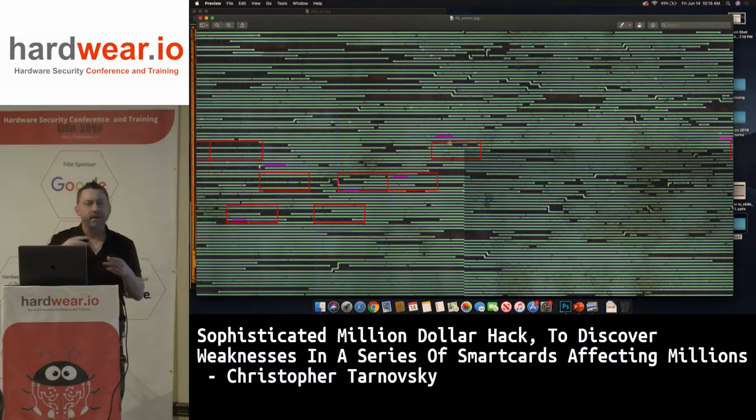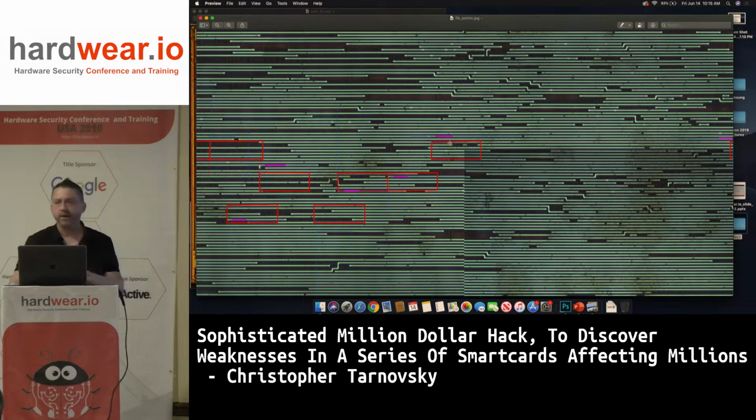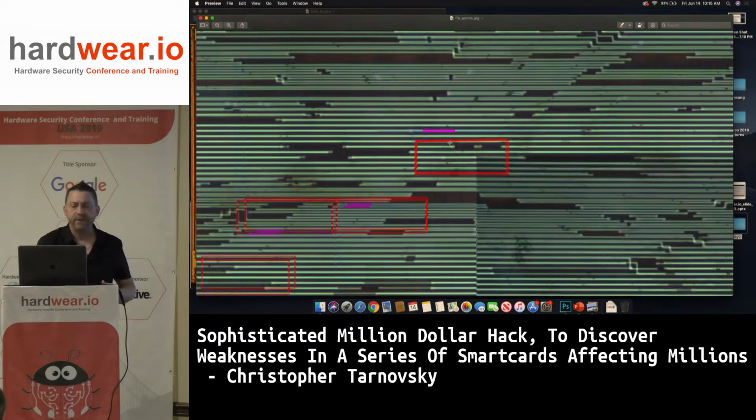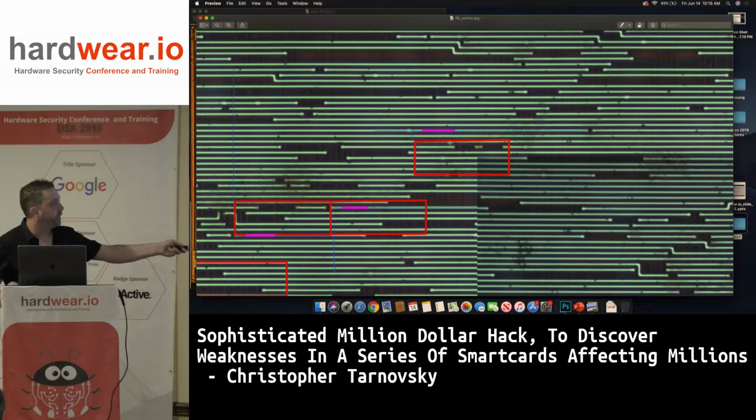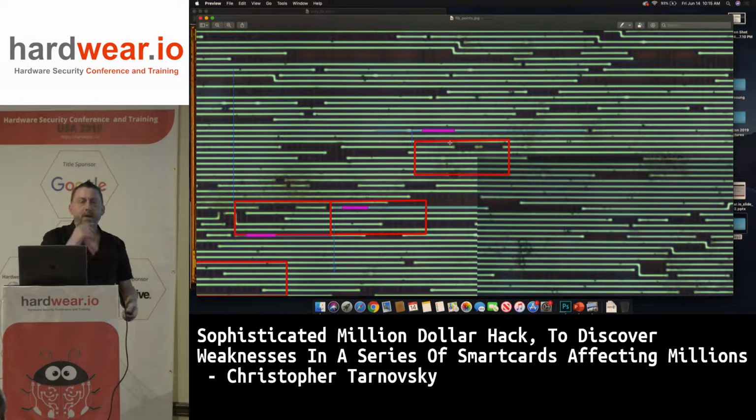So I'm going to put down needles and I'm going to just walk on the bus. Walking means I'm listening and I'm not going to change anything. I'm going to let the processor run. So it's going to give me back the answer to reset or whatever the chip did for its functionality. You can see these are my fib edit lines, like right here. And these are the flip-flops, buried. They're buried, but every line I needed to get to was on top metal.